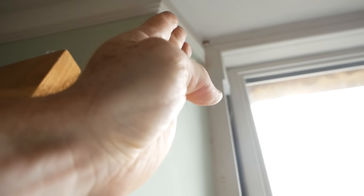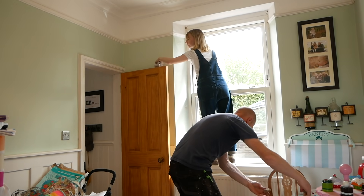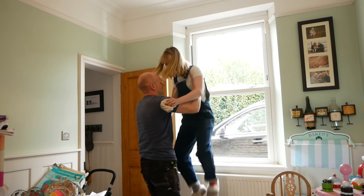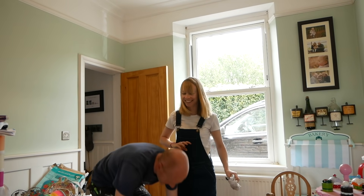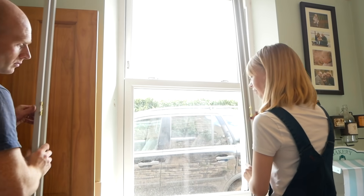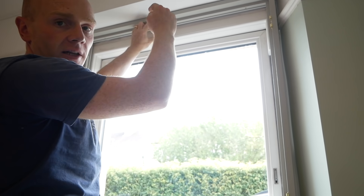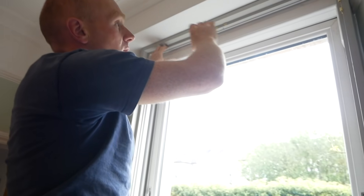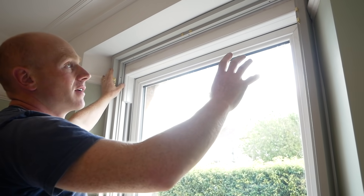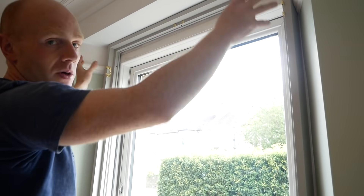You can see I've just cut that picture rail square with the frame going in, so it means that when our frame sits in hopefully that'll terminate into the side. I've shaved a little bit of plaster from the top corner just where it was binding up a bit — I'd rather have it quite snug and not have to worry too much about putting trim pieces everywhere.